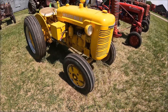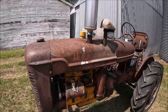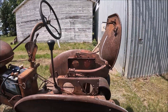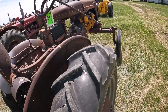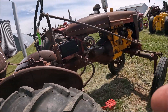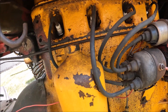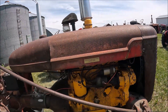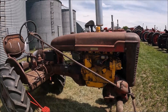It's got the front wheel weights on this one too. Here's a Farmall Super A. Looks like they changed the engine in it. It's got nice tires on the back — they're older but good, not checked. Serial number 252770, so this is one of the very first Super A's. He put a power unit engine in it. I think it's just a 113, but it might be a 123. Hard to tell without seeing the number clearly. A Super A in 1948.